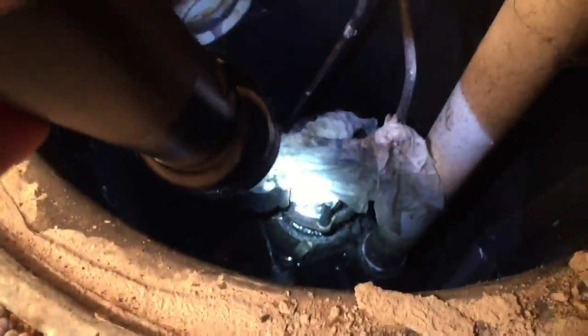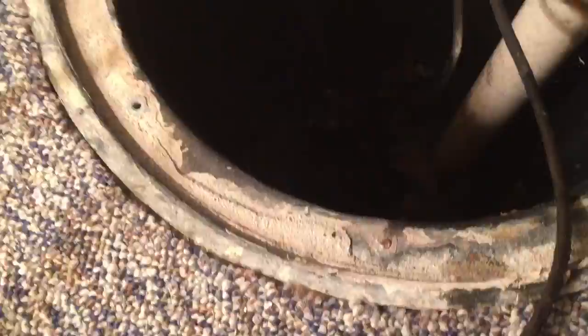I'm going to put some water in here and see what happens. I've got everything cleaned up and the problem turns out to be the float valve — because if I lift it manually, the pump engages and the water drains out. So it was just not seated down there correctly. I've got to figure out how to seat that correctly and that should take care of the problem.